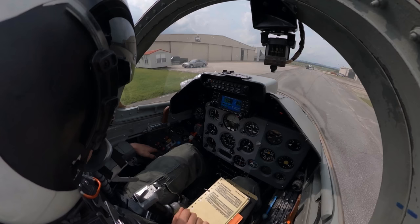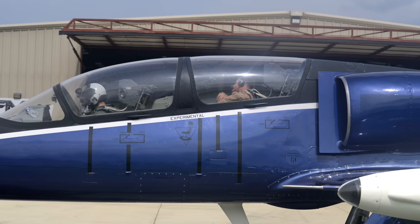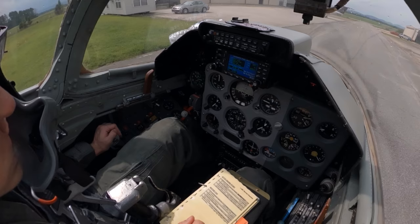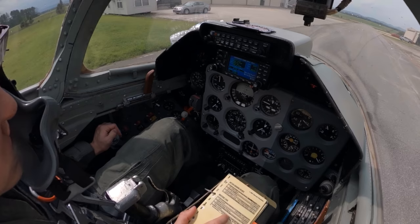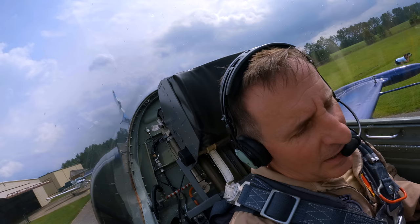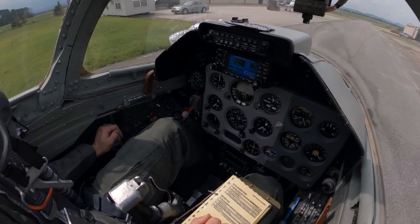Go ahead and, there's the blue button, yeah. Hold it for about 2 seconds. And then bring the throttle over, as it starts to move, right? Yep, there you go. Perfect. 5, 6, 7, 8. Good, 8 seconds, 9, 10, 11, 13, 14, 15 for stable. So that's good. 8 seconds for light off, 15 for stable. EGT hit a max of about 480.